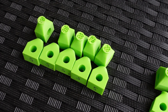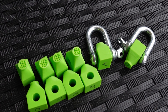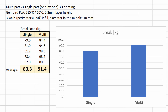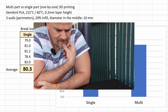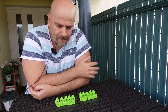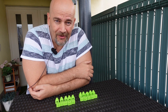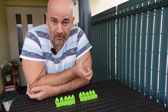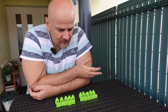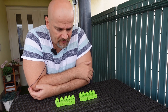The testing is finished and at this moment I can't really tell the difference from the feeling, so first I have to get the numbers from the footage and analyze the results. According to these numbers, the average break load for the multi-part 3D printing method was bigger by more than 10%. So these are really surprising results. A good engineer will give you an explanation to anything — so are there any good engineers among my viewers to help me out? Because I'm definitely confused. I was expecting opposite results, but the difference is more than 10%, so that cannot be a measuring error or printing error or something like that.